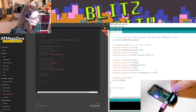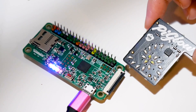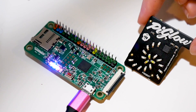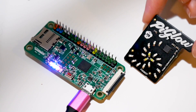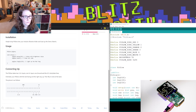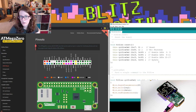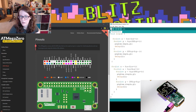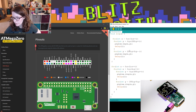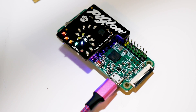But now for hats, bonnets, any board named for headwear but meant for a Pi. I decided to start with the Pi Glow because it's a classic, it's small, and it's actually just regular run-of-the-mill LEDs being controlled by a PWM chip, the SN3218. I found that there was a GitHub repo to port the Pi Glow to Arduino — huzzah! Coincidentally, this repo is by Gadgetoid, who is the lead software dev at Pimoroni. There were a couple things I had to adjust in the code based on forums and a little bit of my own instincts. I guess I'm not that terrible at C. But then we were rolling — or glowing, I guess. Glowing. I'm gonna go with glowing.